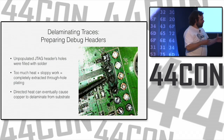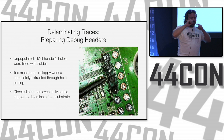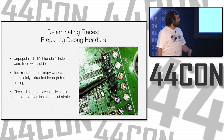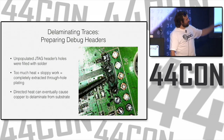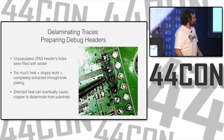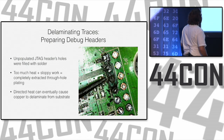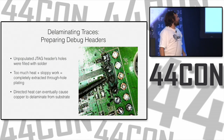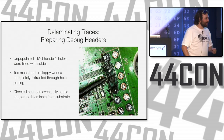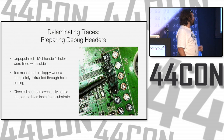And it might be the case where you've got a circuit board that's thick, and the whole thing is full of solder, and you have to get that solder out, and you have to use a solder sucker or a solder wick, and it's just not going fast enough. And you have to do it on all 14 pins, and you have to do it because you have to leave the next day to go use this in a picture in a presentation or teach a class with it. So you turn the heat all the way up, and you really rush through it, and you try and jab the point of the soldering iron through the hole to just get that solder out of there quickly, and you make a mess of things.